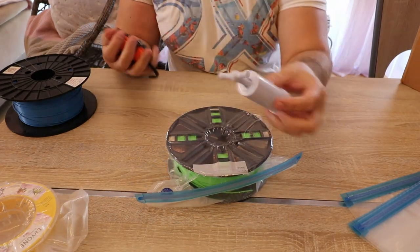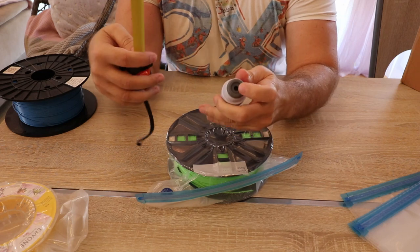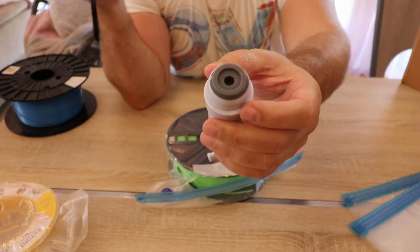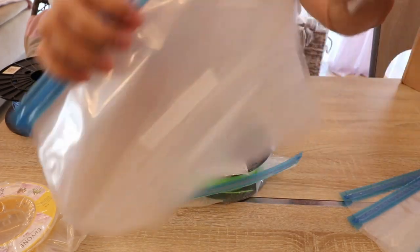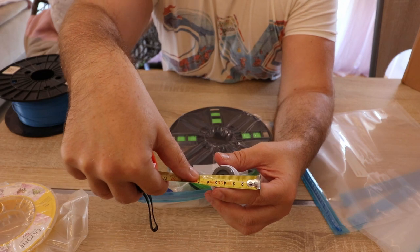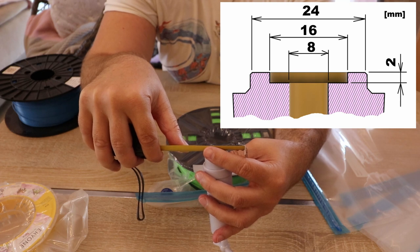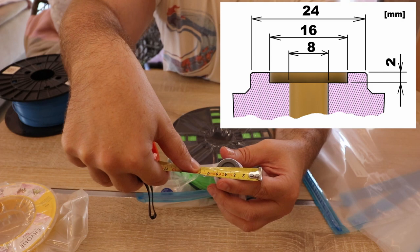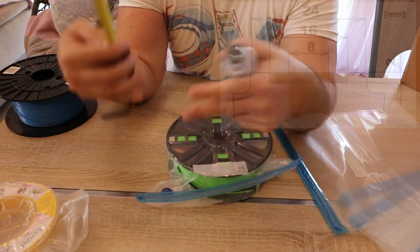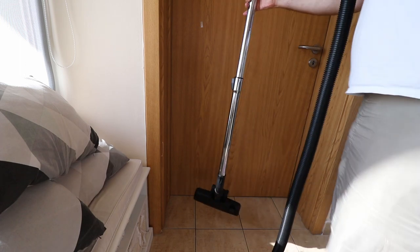For those who are lazy to use the manual pump, I tried using a vacuum cleaner. I want to create an adapter for it. The outer diameter of the valve ring is 25 mm and the inner diameter is 16 mm. The inner diameter of my vacuum cleaner pipe is 30.7 mm. So I will create an adapter for my vacuum cleaner to see if I can use that machine to suck the air from the bag.